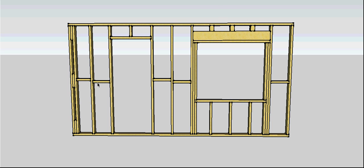Then we have our noggins. The standard spacing for noggins is 1350 mm, and generally what we do is mark a line through the wall and put one noggin above the line and one noggin below the line, so that we can just drive the nails straight through and don't need to skew them — this makes it a stronger job. Although in areas like this it becomes a little bit difficult and we do have to skew. So yeah — noggins, not studs, noggins.